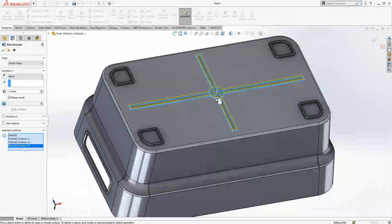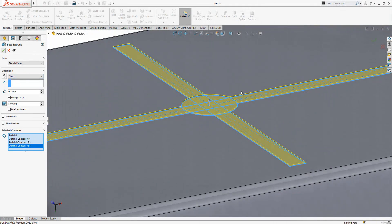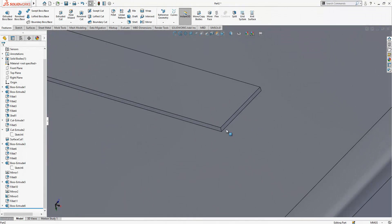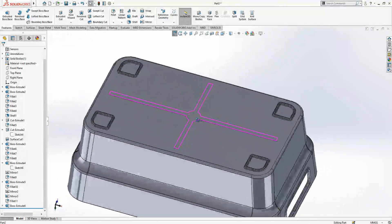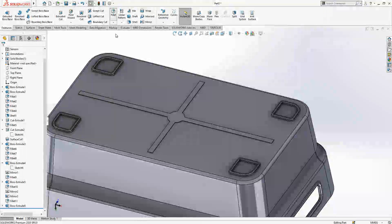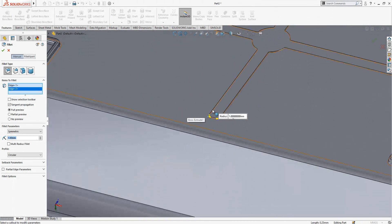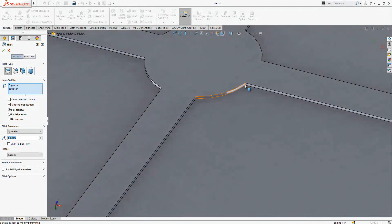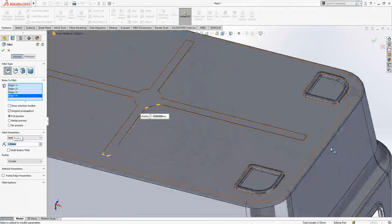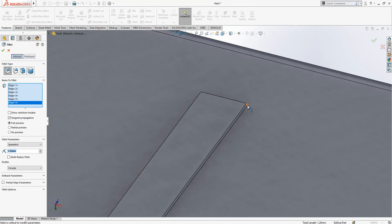We should select the items — so 0.25, with a 5-degree angle. The material is thin and there is a delta in the temperatures. When material starts to flow into your die it will have difficulty to move, and this kind of addition will add stiffness and help your material flow. It's good to keep in mind that if there is no prohibition due to aesthetic aspects of the part, it's always good to have ribs and these kinds of little additions. Let's make it bigger since this is an invisible surface — it will make your life always easier to have it on your part.